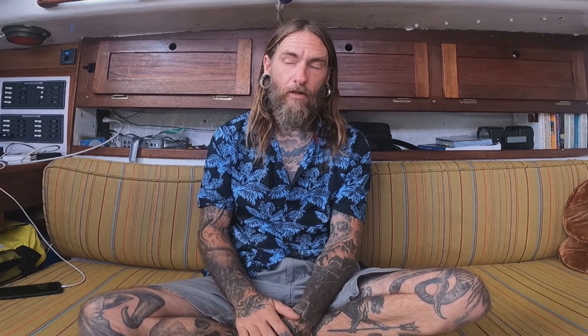With this steering setup, you actually want the drogue not that far off — the furthest it was ever aft of my transom was maybe 15 feet. You want to be able to see it and pull it close in. There's no reason to have a hundred-foot line behind because you won't get the same maneuverability if it's too far aft. I found on my 30-foot boat that 60-foot lines were kind of perfect. I ran those from the cockpit to snatch blocks on the jib rail amidships, then aft through the eye of the spinnaker pole, and continued aft tied with a bowline to the end of my drogue.